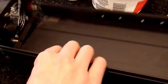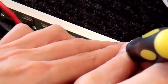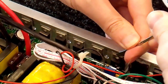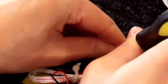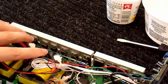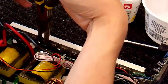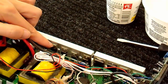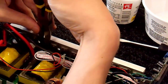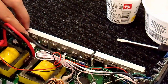Remembering which way it came out, I also need to take this heatsink off of all these transistors. Same thing — it probably glued on when it got hot. So take your screwdriver, put some force on it, pull it forward, and pull these FETs away. It turns out that many of these are stuck on there really, really well. As a backup plan, you can take pliers and pry them off. When you squeeze, don't squeeze the plastic body — you can crack it, or even delaminate the silicon from the heat plate in the back. Just grab the metal heatsink portion if you can, give it a little twist, and they'll pop right off.